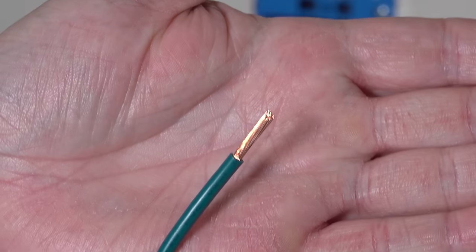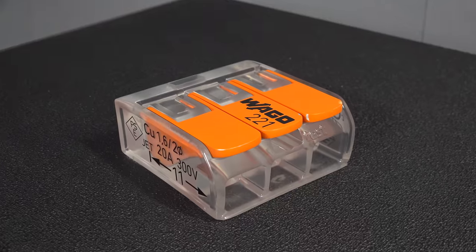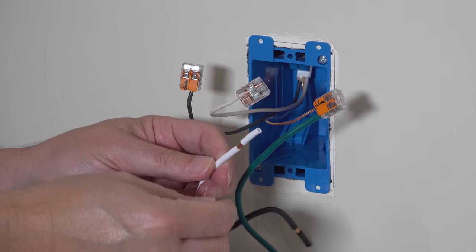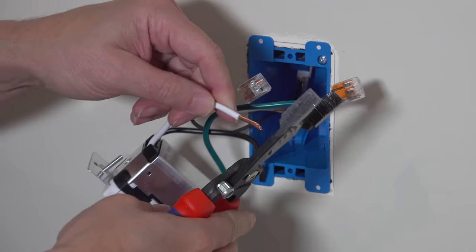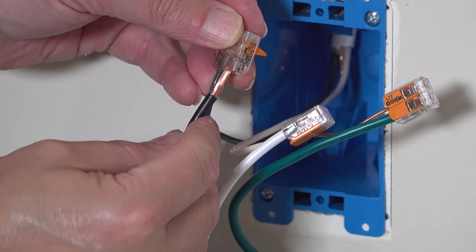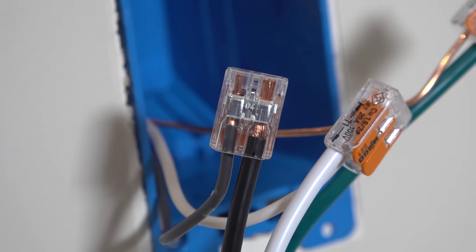Here's a bonus tip that is going to make this even easier. You'll notice that these wires are actually stranded. We usually use solid wire and that's always what you're going to have inside your walls, so this creates a problem for making the connection. Connecting solid wire to stranded can sometimes be one of the worst situations you'll encounter. You could use a wire nut but often times they'll fail or you won't get the tension correct. A way better option is to use a WAGO connector — these are perfect for connecting stranded to solid. The wire from Leviton is a little bit too long so I'm going to trim this back slightly. On the side of the WAGO connector there's actually a strip gauge that tells you exactly how much conductor length you want to have exposed to get the correct connection. Just snap down the levers on the WAGO connectors and your connections are instantly made. The stranded wires are rock solid and won't pull out — and because these WAGO 221 models are transparent you can verify that the wiring was done correctly.